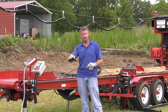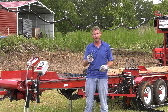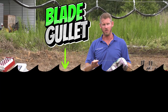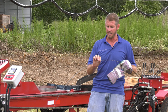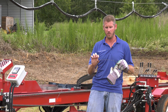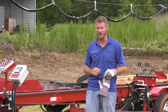When I start getting into faster speed, more production speed — 60 to 100 feet a minute on our bandsaws — I'm taking a bigger chunk of wood. That chunk rolls down the tip of the tooth, comes into the gullet, and that gullet pulls it out of the cut. The only purpose for the gullet of the blade is to pull sawdust out of the cut. It does not have to be sharp or sharpened. The tip's got to be very sharp, it can't have any dull edges. I do have to have offsets on the teeth — that creates a pass — I don't generate heat, and that gullet's going to pull sawdust out of the cut, which gives me accuracy and keeps it straight going through the wood.